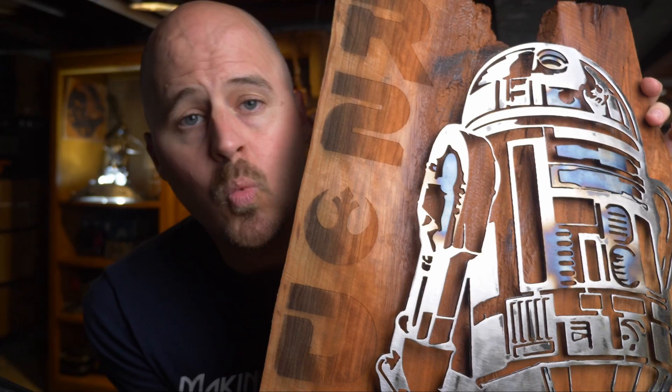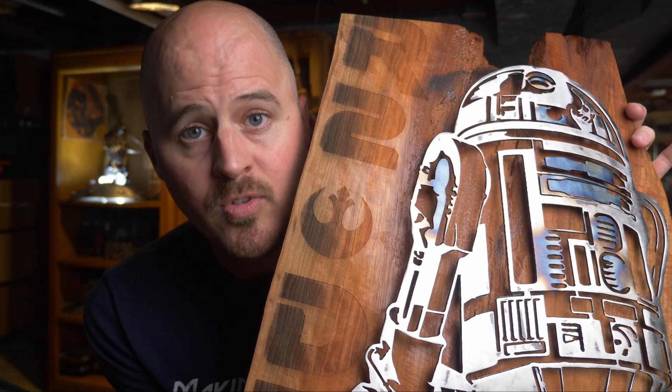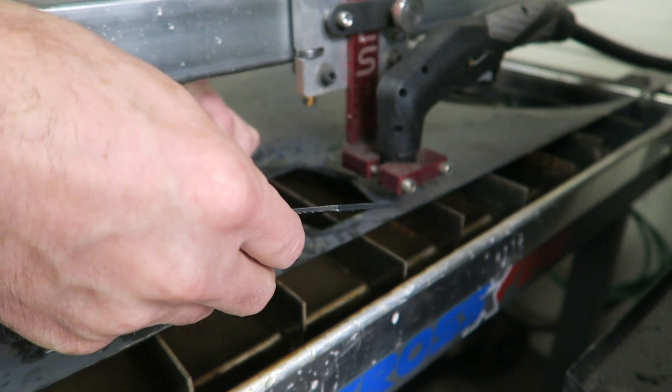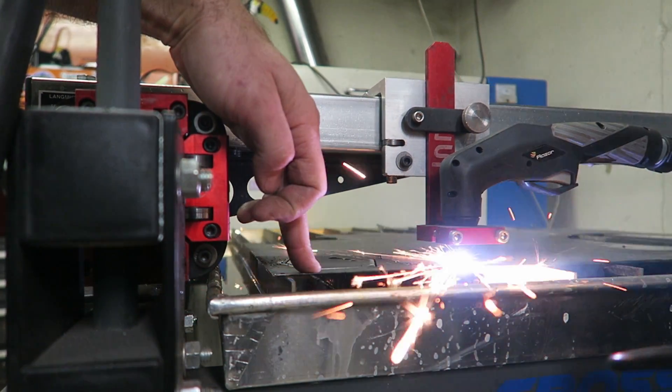This machine does not have torch height control — it's only got X and Y, there is no Z. When you're doing a really intricate cut like the R2-D2 piece here — which yes, was cut on the Langmuir Systems Crossfire — you are on tip-up patrol. A tip-up is when one of the pieces you've cut tips up on the table. I'm doing all the programming in Fusion 360 and there is a tip-up setting, but when you get really complicated cuts, I've found that setting is not reliable. You can't set this machine and forget it. You need to stay and monitor for tip-ups. If you're cutting thin sheet metal, you need to either clamp or hold it down because if it catches a tip-up or a little slag bead, it will shift the sheet metal and your pattern is garbage.